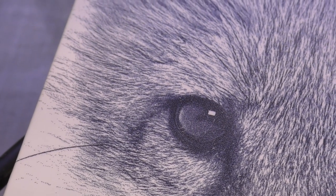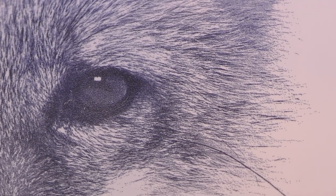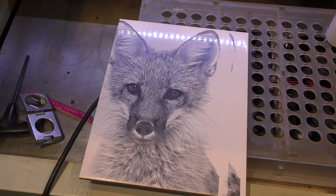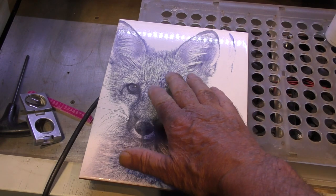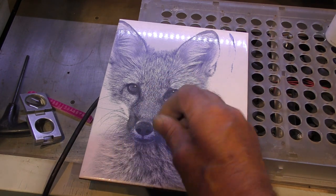Some areas lacked enough penetration - the whiskers just weren't making it through at lower power. I haven't yet checked pixel-to-dot ratio under the microscope, but it looks pretty good. After washing the titanium dioxide off under water with no solvent required, the result is unchanged. This is what I call photo engraving - copying every pixel in the picture. Zooming in: the eyes have come out extremely well, we've got all the hair details in the ear, all those very minute hairs down the side of the face, and those lovely whiskers. It's probably one of the best versions of that picture I've ever managed to create. I can only thank Nicky Knowlton for discovering this process.